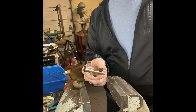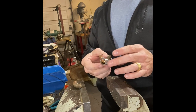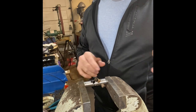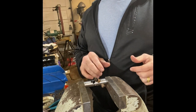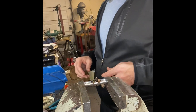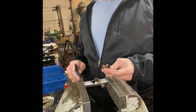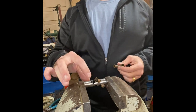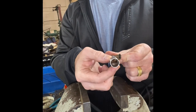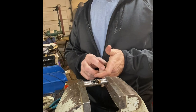You've got these long legs that stick out — the piece goes in and gets annealed with a torch, then you bring them up, get them warm, and start opening the ends of each tube. This is the second piston — I keep calling them pumps; when I worked in the industry the other shop called them pumps, but they're pistons. The difficult part is that you're connecting two holes, one on each side, and you need to find a curve with a radius that can fit between and go through to actually connect those two holes. It's not as easy as you would think.